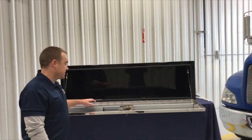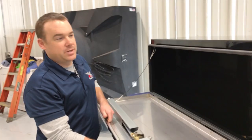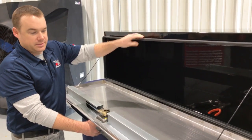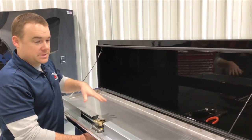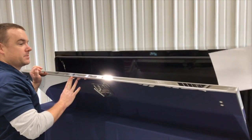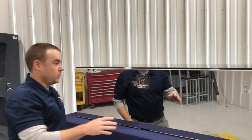Thanks Kip. These boxes come with the latches adjusted from the factory. Occasionally they do get out of spec. This bulb seal is a compression part — this door is compressed over time, so you will have to tighten your toolbox latch eventually. We're going to show you that this one is a little bit loose. I like to stick a piece of paper in there — that paper comes out way too easy.